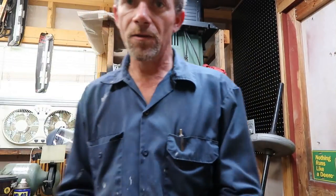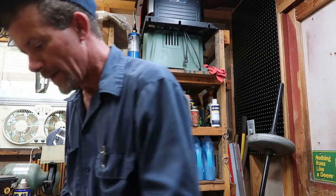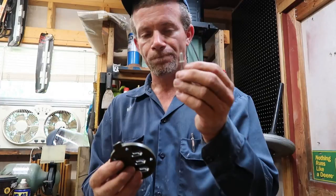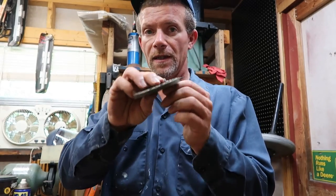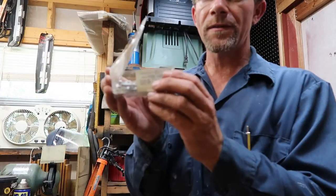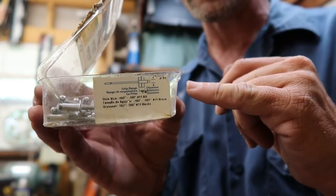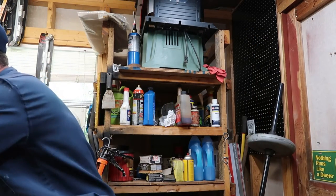How am I going to attach the adapter plate after I drill the holes? First thing we need to know is what size holes we're going to need. I found some eighth-inch — that's the shank size of the pop rivet — with a quarter-inch diameter pop rivet. On the pop rivets, if you read the side of the carton box it'll tell you what size drill bit to use. This one uses a number 11. A lot of people may not have a big assortment of drill bits, but I do, and we've got the number 11 right here.